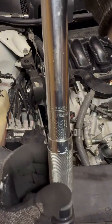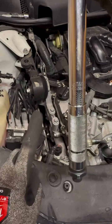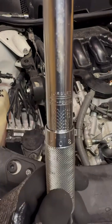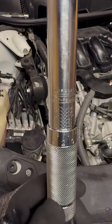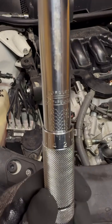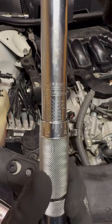We take the torque wrench and turn it until we reach zero — 20 is here, until we reach zero. To give an example, if you want it at 25: when the zero is on 20, it means it's at 20. So 21, 22, 23, 24, 25 — there we are at 25 pounds. I'll bring it back to 20.